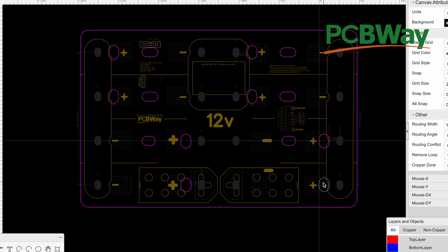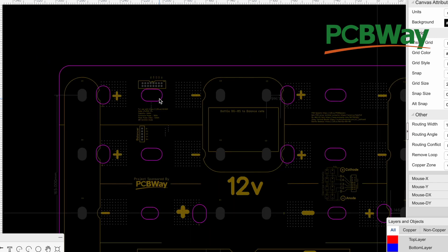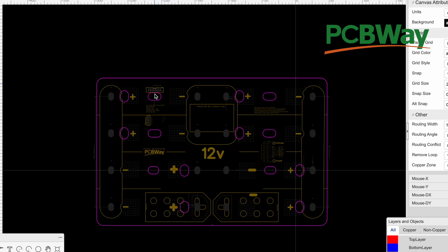These are little pucks that stick out on every cell and they're only present on the positive side of the cell — the two positives are over here and here. Then we have our connector here for installing a BMS, and this is for a balancer. The same pins are right here. This connector will allow you to connect several of these batteries together in parallel, and with one of these cables even the balance wires are parallel, so you can have one balancer that balances the whole thing.